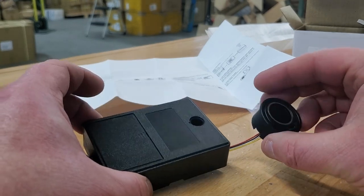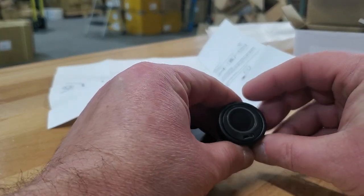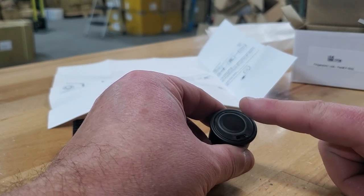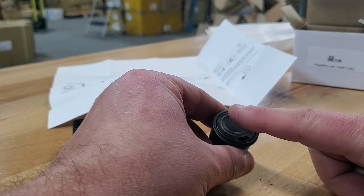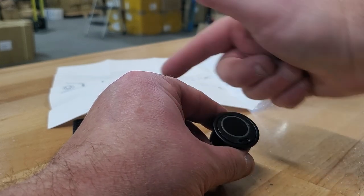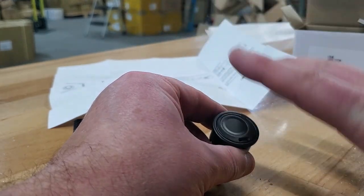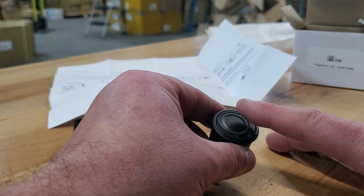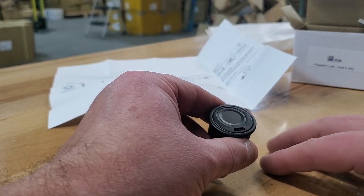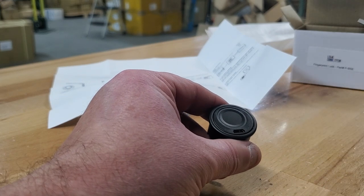Any print will open the lock initially. To set the first print, this is going to take about a total of 10 seconds. You're first going to put your finger on the sensor area and hold it there. Don't remove it. It's going to go green, it's going to unlock, the plunger is going to pull in, the plunger is going to come out, and then still hold the sensor. Don't move your finger. Eventually it's going to go green again. Once it goes green again, release it and it'll be going blue. Once it goes blue, that is when you put your finger on the sensor — I believe five times — to set your print.